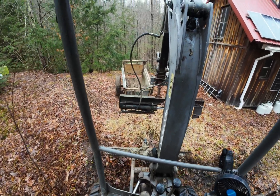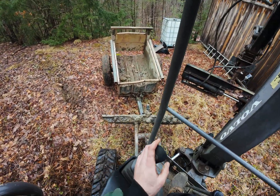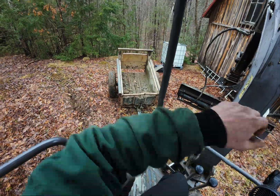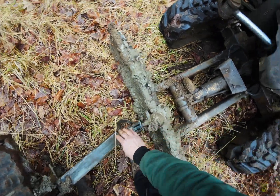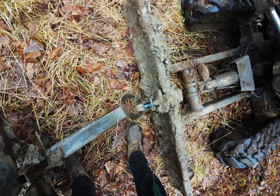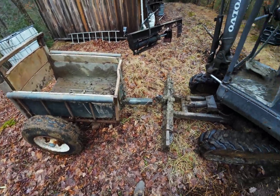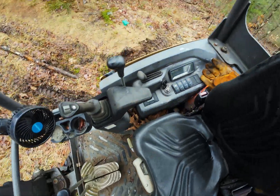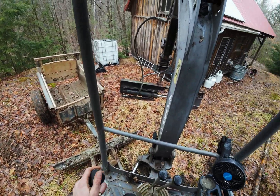So we're just going to hook this little firewood cart — the excavator cart — up here. Made that a while back, works great, holds about a yard of soil. This hitches up to a pin hitch. I recommend if you ever get an excavator, torch out a section of the blade and weld in a 2-inch receiver. I'm sure one could argue the wheel motors don't like pulling a trailer, but you can push dirt with a blade. Haven't had an issue with it yet — it has a ton of power and can easily pull over the weight of the machine.